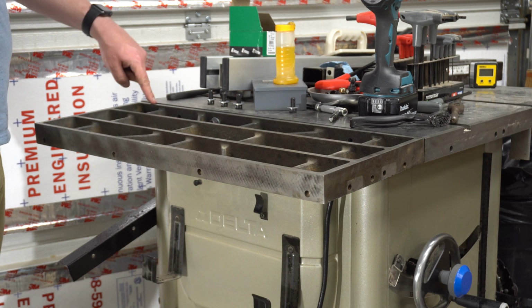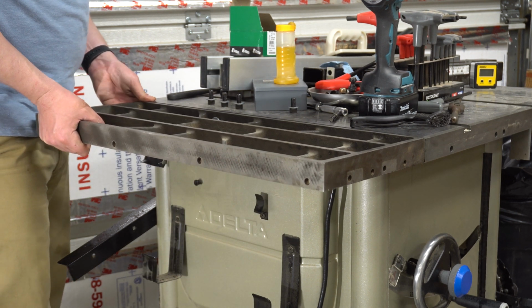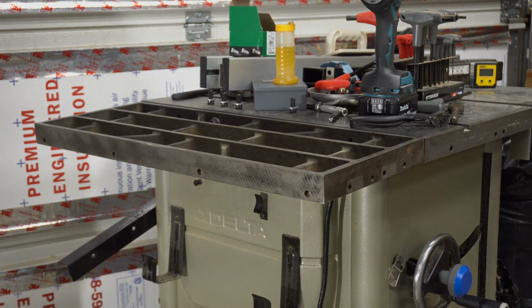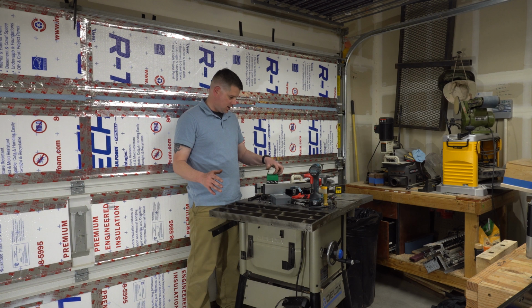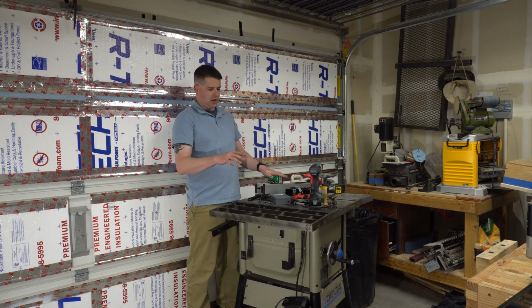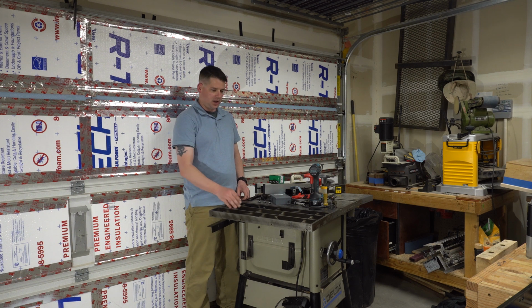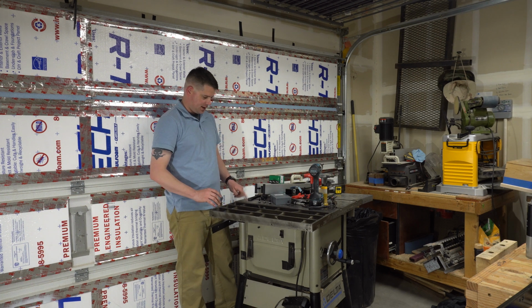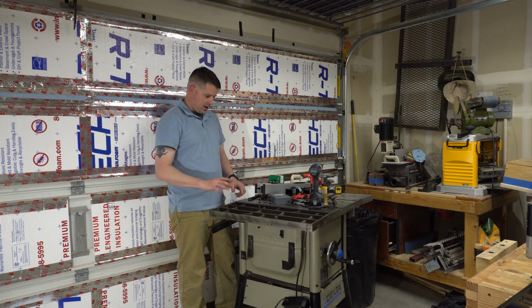I'm gonna make these holes bigger. And when I tighten it up, I'll just make sure I get it to the right height to make sure it's flat across the plane of the tabletop. Well, that's all I'm going to show today. This is going to be the end of the video. The other parts you already kind of see me do on this. I have to change the types of cap screws I'll be using for this. I'm going to clean it up a little more and use some black enamel paint on the inside. Do the top like I do the tops of this and the drill press and the bandsaw that you've seen in other videos. And then that'll be it.